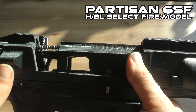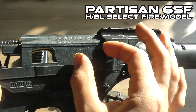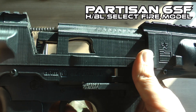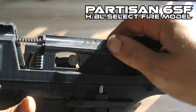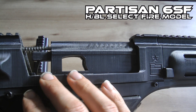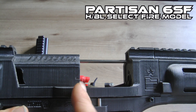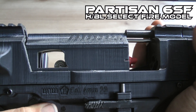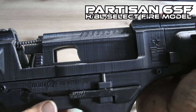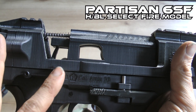Not everybody has an open-framed upper to diagnose things like this. But if you're shooting through the ejection port and you don't see the bolt bouncing, yet you still have a dead hammer after one shot, you'll notice when you cycle it manually that the hammer was released and hits the bolt — so there might be a timing issue. It's also good to note how far the bolt can move and when it resets the hammer. Making a mark on the bolt can tell you if it's a short cycle issue or a mechanism problem.